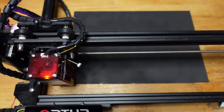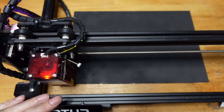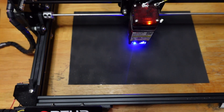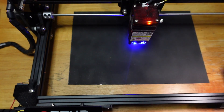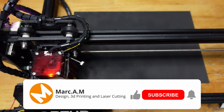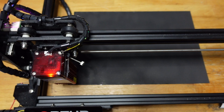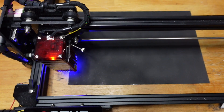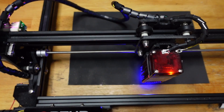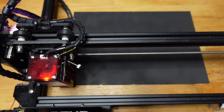So we've got the design loaded up in LaserGRBL. I've got the laser itself ready to go. I just need to make sure to home the laser so I can centre it now. You might not be able to see it there, but the little cross is directly in the centre — I can press centre on LaserGRBL. Looking down I can see, yep, that's perfectly there in the centre. I can go to corner and bring it down to the bottom corner, turn the beam on, and I'll run a quick frame around it all — that'll let me see it run around. I'm happy with exactly where that has gone, so I'm going to run the engraving at a speed of 5,500 millimetres a minute with the power of 65%.